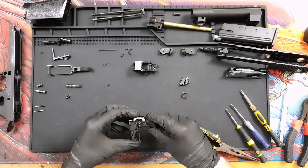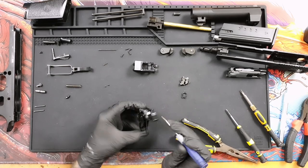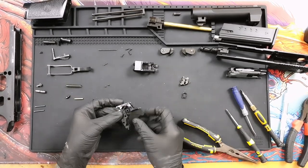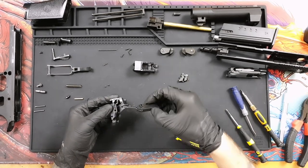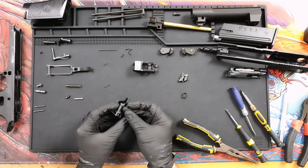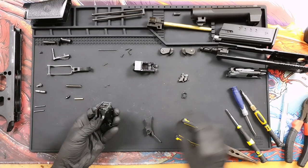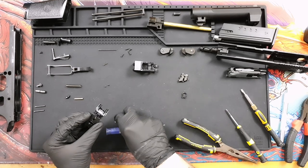Okay. Get out of there, boy. So, hammer is held in with a little brass pin. Which we can push out from either side. He's cool. Now he will just slot out. So, you can only get that out with this off. It can only slot in through there. So that's our Valve Knocker, if I can get him out. Whoop. Spring's still in there.